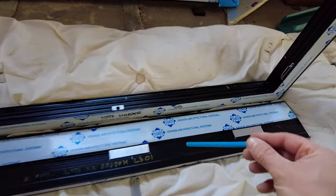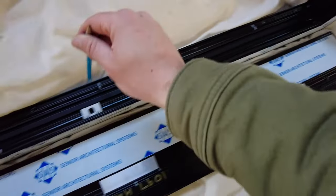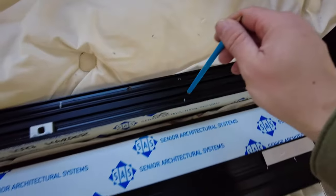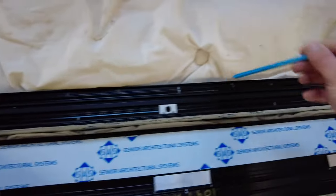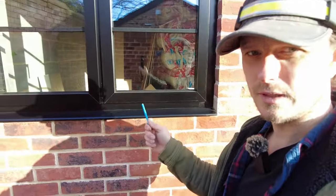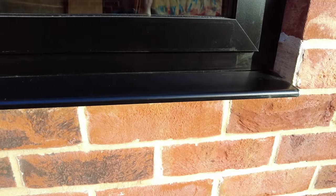For this particular manufacturer the recommendation is going through the seal inserts and through the channel. I need to make holes through here, place the seal on top, and then screw it in. For this particular seal I'm also going to do two fixings here because I want the frame really tight. With the first window I fitted there was an ever-so-slight gap, so I want it really tight — I'll put a bit of silicone in that gap. For this one I've got no gap because I'm doing five fixings.